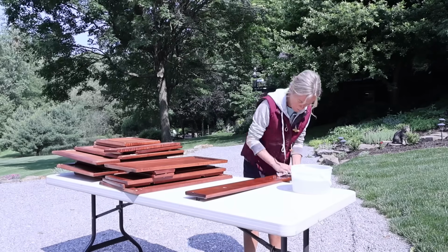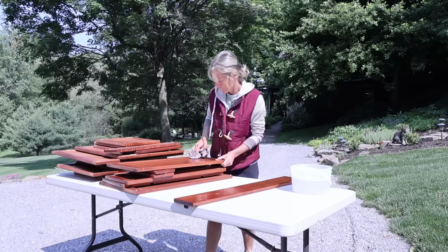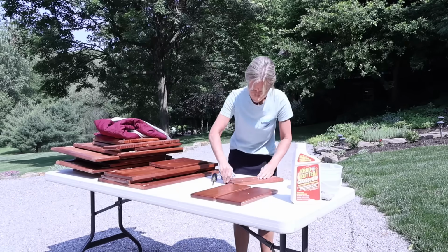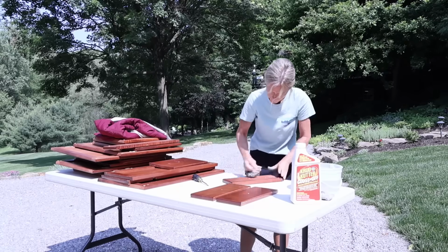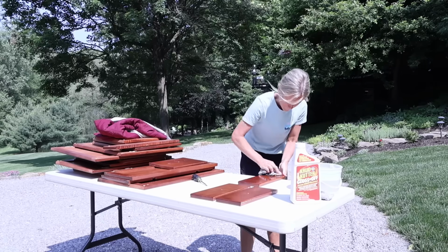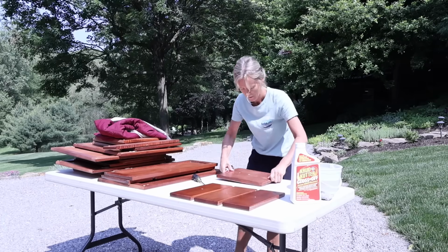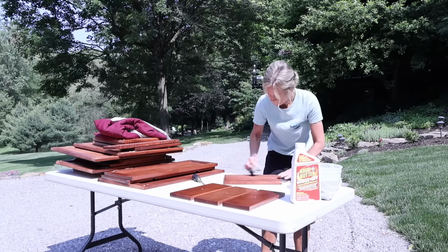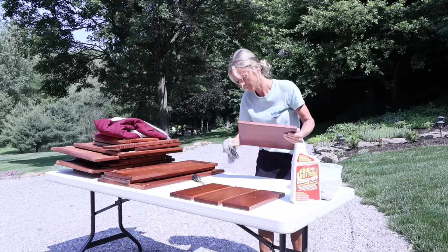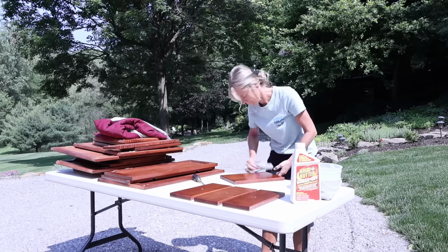And some of you might be wondering, why isn't she using sandpaper, sanding the door down a bit? I think I've mentioned this before on my channel, but I have learned over the years, sometimes when you sand too much and get down to the bare wood, it actually releases some stains that come out, or after you apply the paint, it causes some stains to come out. So I've learned it's actually better to just leave the old finish on here and just try to dull it up a bit, and then maybe work on a good top coat to try to keep your paint to stay put.